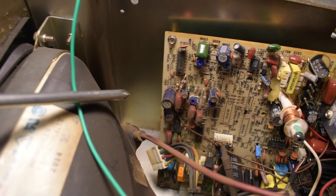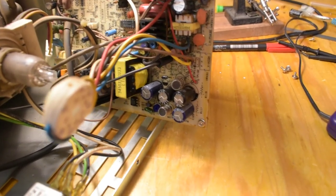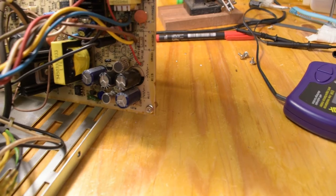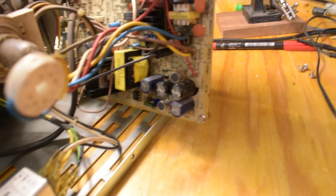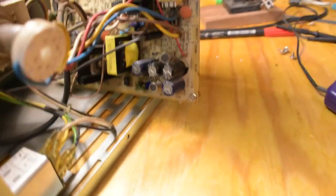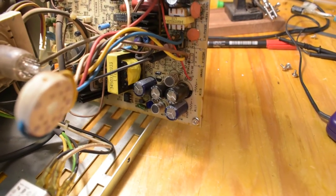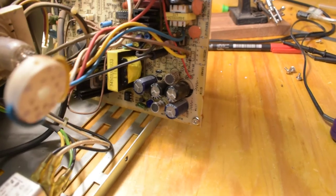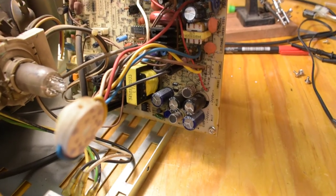These were definitely suspicious, but they seem to be okay. And all the ones at the bottom too — they were all okay on the other one. Interestingly, there's a mix of types of capacitors on both of these. It's as if they were recapped maybe 10 years ago, but the most recent caps are a Luxon brand, which are kind of infamous and notorious for going bad in motherboards or monitors of that period. What a poor choice of recap.